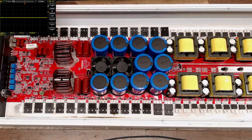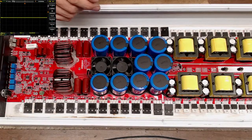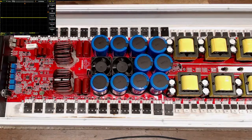The SI8244 IC, which you're going to find in a lot of the Brazilian boards. The IRS20957S is another really common drive IC, and the 2095 is another common drive IC. I think the 2095 I find in a lot of the smaller B2s. And the 2957s I find in the B2s. And the SI8244s I find in the tar amps, of course. Sound Digital uses the SI8244s.